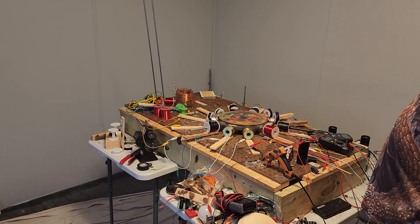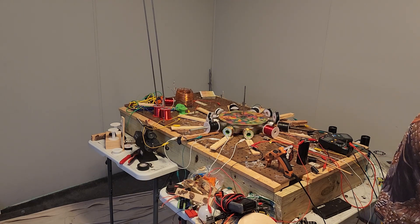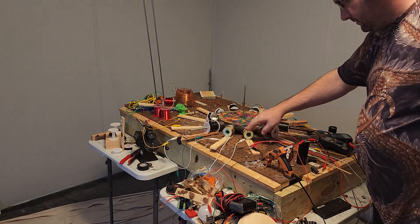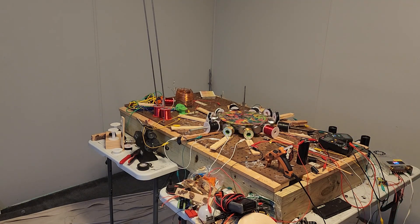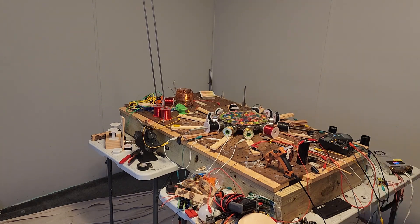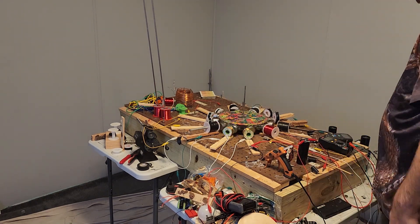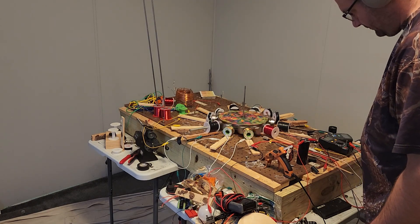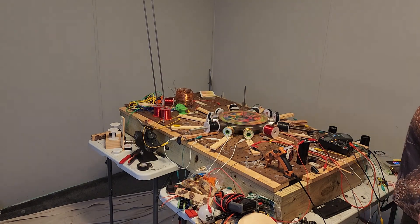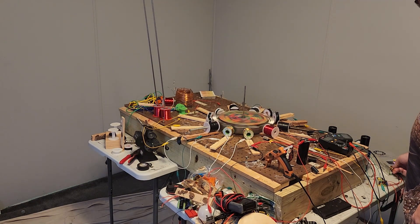From beginning to end it's about 250 volts getting dumped into the capacitor when it's going really fast, but it's still not enough — there's not enough current to make it jolt. You know how when a magnet passes the drive coil it'll jolt a little bit if it's not at capacity speed? I need some of the current to make it to the other side. I'm going to change it all to one millimeter coil wire, maybe bifilar with one millimeter and 14 gauge. Thanks very much, please subscribe, have a good night.